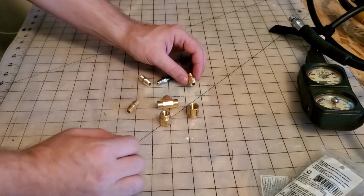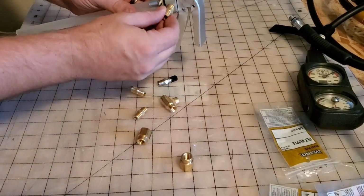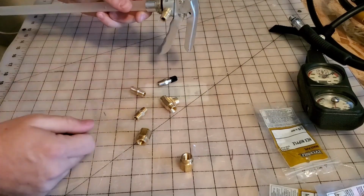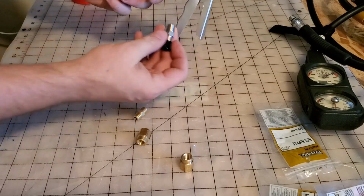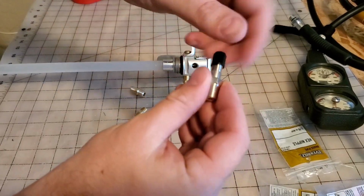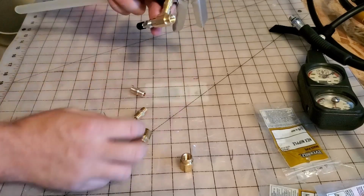Okay, so this is what I ended up with. What I'm gonna do is, coming off of this side, it's gonna be an 1/8 inch hex nipple, hopefully. 1/8 inch hex nipple, and then I got a T, and then I got a Schrader valve here. It's like one of those valves from a bicycle, and that's gonna allow me to air up the tank. So I'm gonna put that on here, and then another nipple,